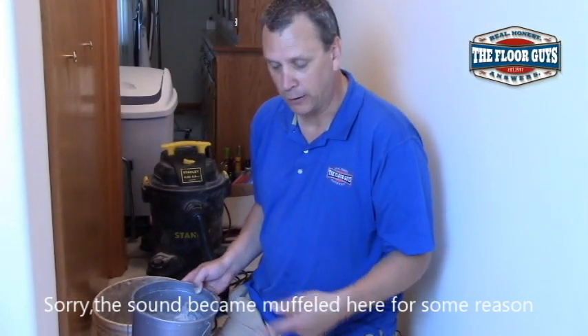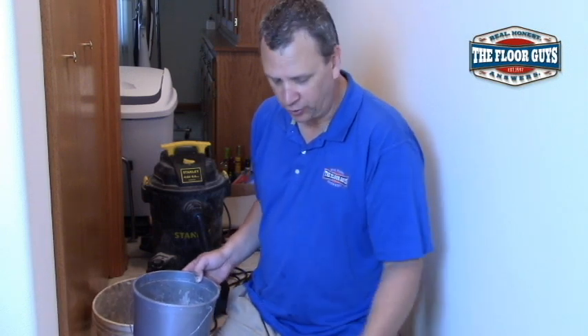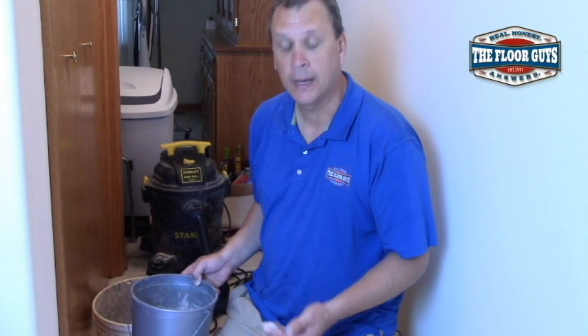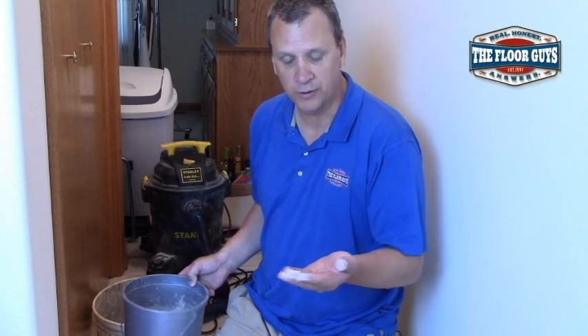When I come down and I'm repairing grout, I just push it in with my fingers. You can get a float if you want, however you want to do it. I just like to push it in with my fingers — I can feel what's going on. I leave it on the top a little bit, let it dry for a few minutes, wipe it off, and we're good to go. So let's get at it.